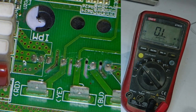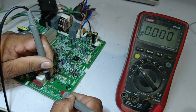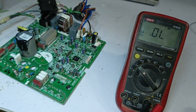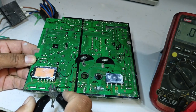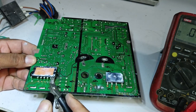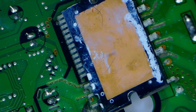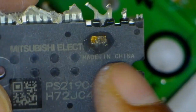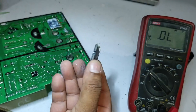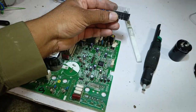However, we will still remain doubtful because until the microcontroller work is finished, nothing can be confirmed. Because the IPM pin is still showing zero, we need to proceed quickly. I will cut the IPM pins directly from the circuit to get the work done faster. I have cut the high-side pins of the IPM. The IPM has burst from the bootstrapping point, which is a bad sign — it shouldn't have burst from this side. However, a fault can occur anywhere. We will replace it with an identical IPM.